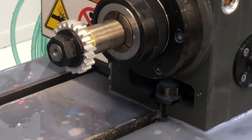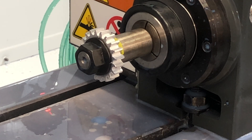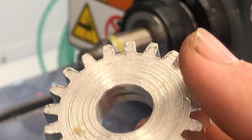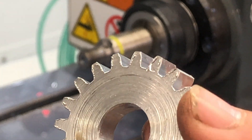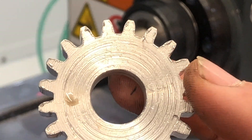In this setup you'll see there's a tailstock — we're getting it aligned. In this example that Raleigh's doing, we don't use a tailstock. It's a short little gear, not too big, so not a big deal. If you get into much bigger, toothier gears, you'll want to use a tailstock for your setup. There it is — our milled gear, just like that. There's a little bit of a burr on that front side — no big deal, take the deburring tool to that. Looks beautiful.